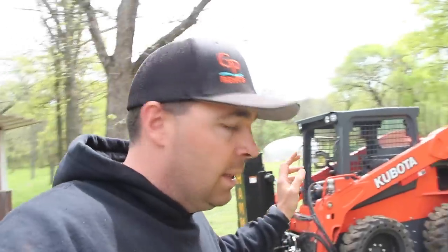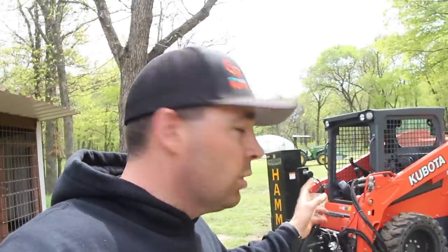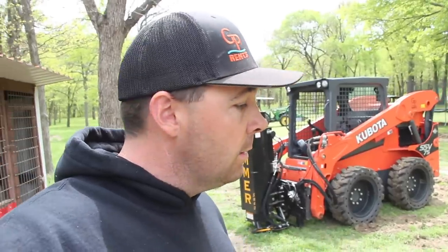But this thing is a time saver and a half. We drove 17 pipe in the ground today. So if we were gonna dig all the holes, we'd have had at least a full day of digging posts and then come back and concreting those posts in the ground, which would have been about 2 bags of concrete a piece. So we're probably roughly looking at about $150 to $160 worth of concrete. Plus, if we would have had to have rented some kind of machine to dig the holes, whether we use the walk behind auger or an auger on a skid steer, auger on a tractor, whatever it was, we'd have had to have rented something